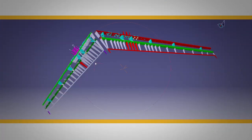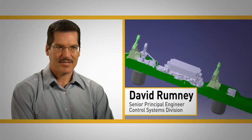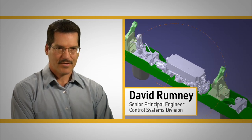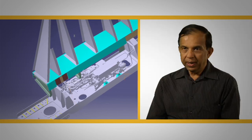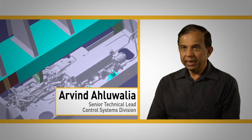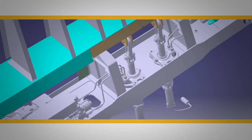The application for this particular aircraft brings together a unique combination of not only fly-by-wire but what we call power-by-wire, and also remote electronics. That combination was rather demanding. One of the things that we have done with this approach is connecting the pilot controls to the actuation by means of a data bus.